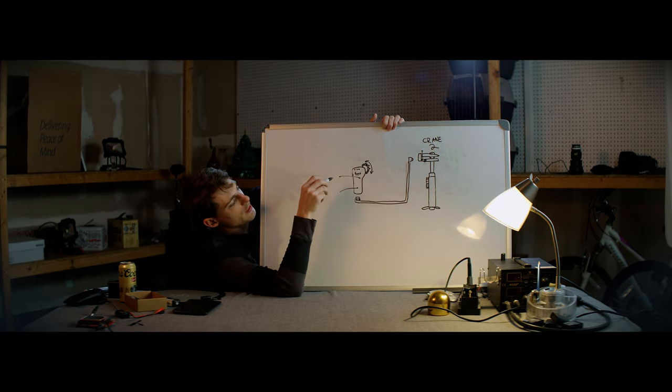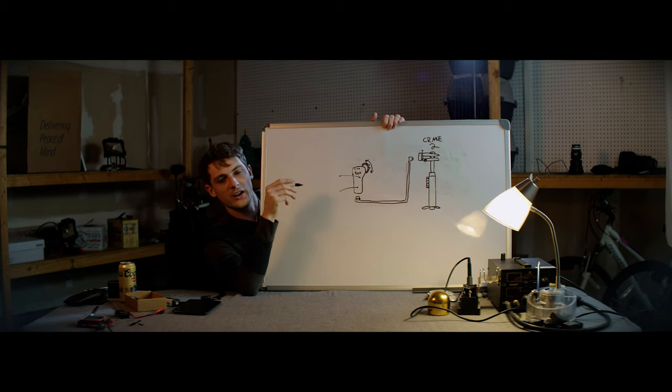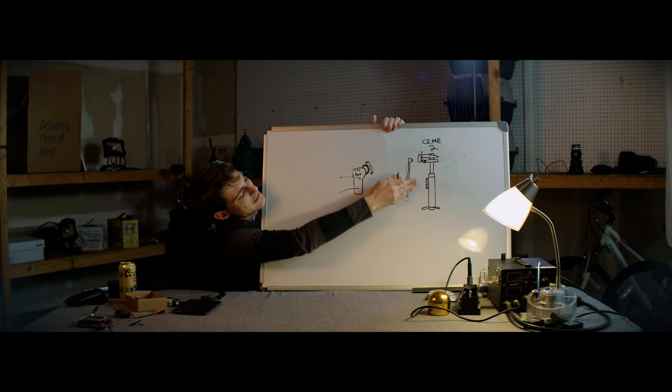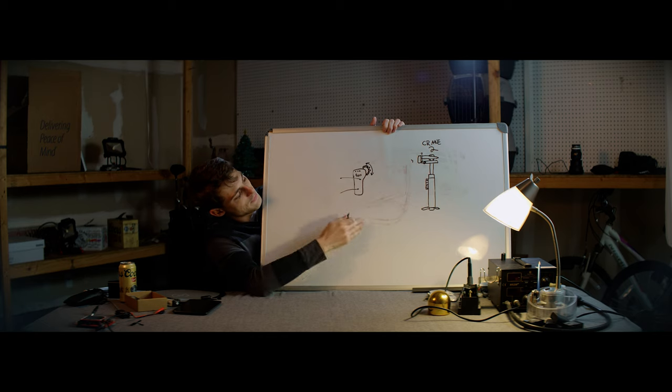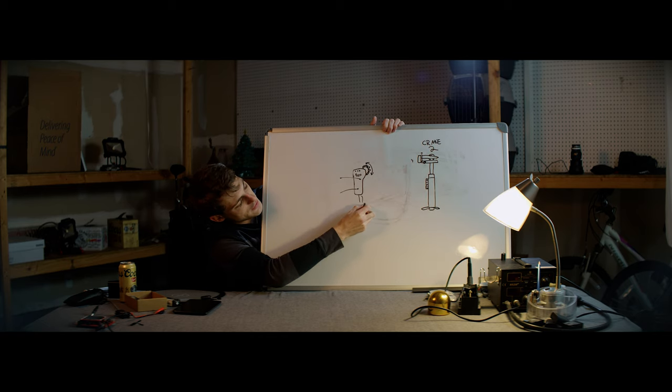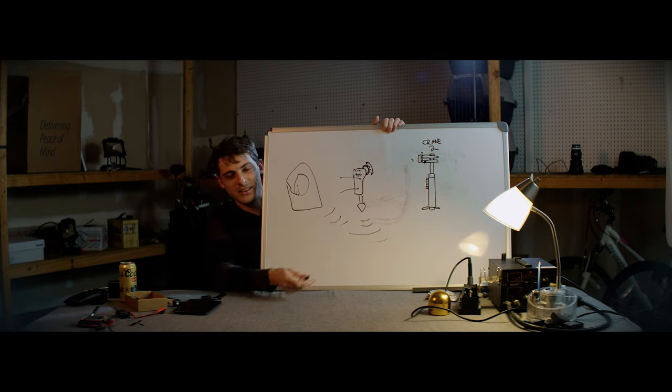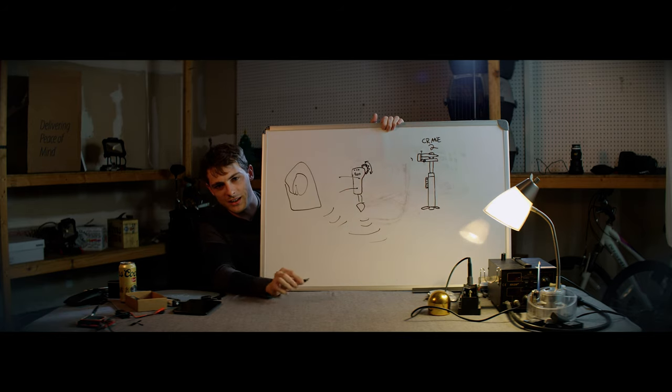What we're going to do on an analysis standpoint is connect the motor to the Crane, and with the cable attached we're going to solder some little probes onto the main circuit board for this motor and see what we find. If anything looks interesting, we'll take that and run with it to see if we can mimic the signal. The end result would be to delete this whole wire and attach our Bluetooth module to send the commands that the gimbal was originally sending.